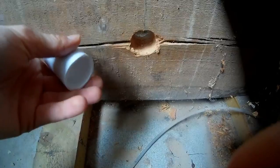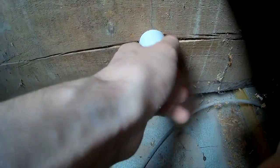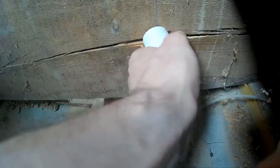We drilled an inch and a quarter hole for the inch and a quarter waste, yeah? No problem. However, inch and a quarter is an internal diameter. So there's a nice interference fit with our waste pipe today. So, we're going to get round that problem.